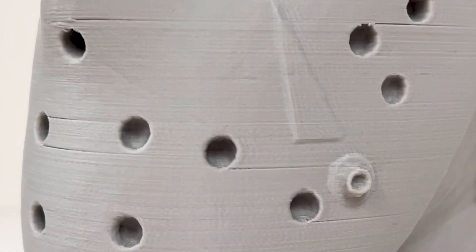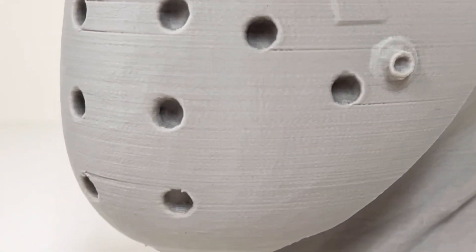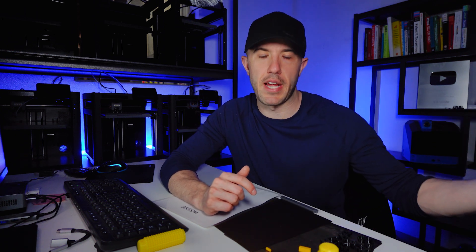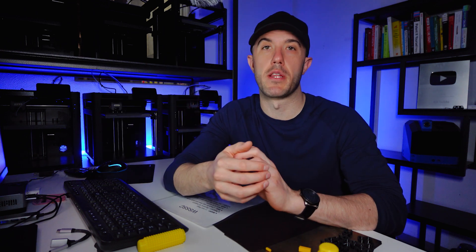Next, you go to skip lines. Skip lines are literally that — is there some sort of blip or bump on the surface of the part, or is the seam messed up because of retraction issues, or issues with material flow? These can be a range and sometimes ambiguous. If there are pockmarks all over the part, that obviously needs to be reprinted because the extruder is slowly jamming or there may be filament contamination. They check effectively for pockmarks over the entire surface — are there gaps, holes, blobs — looking for skips.